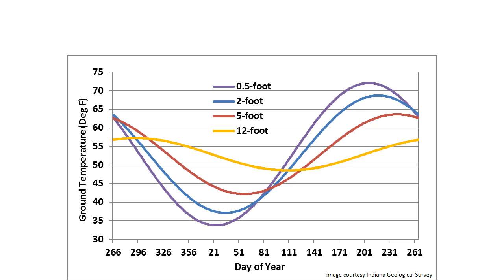Why are we doing this? Here's a plot of ground temperature at different depths throughout the year. The low point is in the middle of winter. We've got depths ranging from essentially at the surface, two feet deep, five feet deep, and twelve feet deep. Notice that at twelve feet depth — where I've drilled my wells — the average temperature in this area is about 52 degrees, with pretty minimal variations throughout the year.